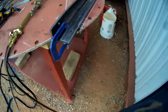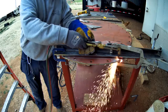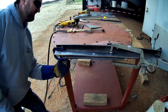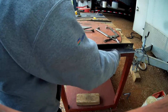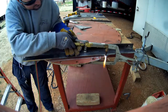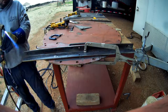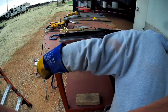It's always a good idea to clean all the schmoo off your straight edge or it'll give you a false reading of how not-straight it is. You can see the air gap there on both ends. That's the price of doing business when you're blacked out drunk. I'm going to grab the vice grips — I've got the tacks in the middle. I grabbed it on one edge and the other, closed it, squeezed it, saw that it moved. It didn't move enough so I pulled the vice.